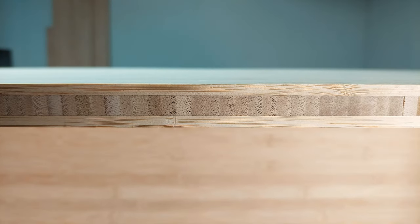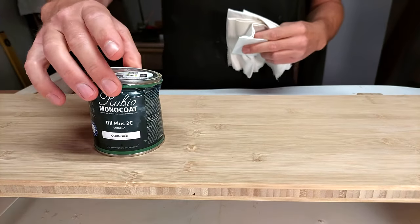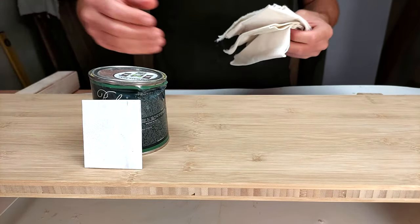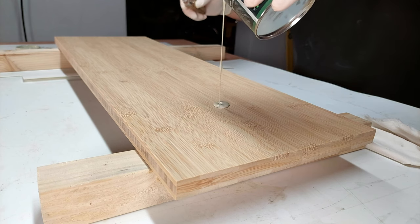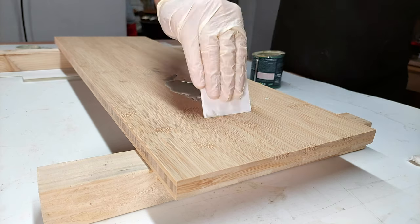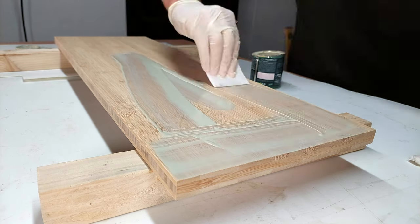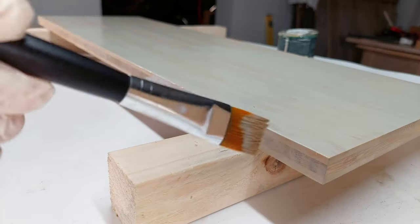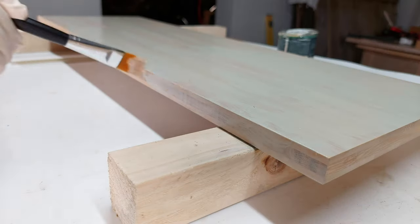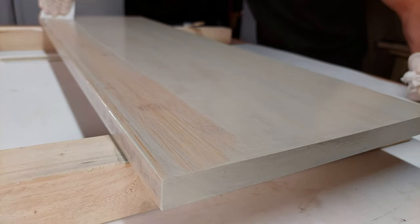During this time I did some sanding so I could apply oil on the cabinet. A wrinkled can of oil, a homemade squeegee, and some cloth will do the trick. I drip on some oil, scoop out the pudding skins, and use the squeegee to distribute the oil over the surface. With a small brush I painted some oil on the sides as well, then removed the excess with the squeegee and finished the surface with the cloth.